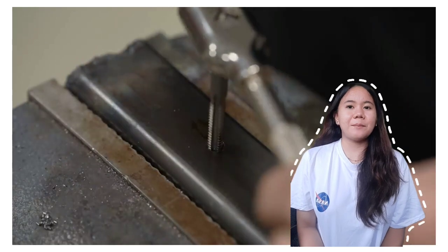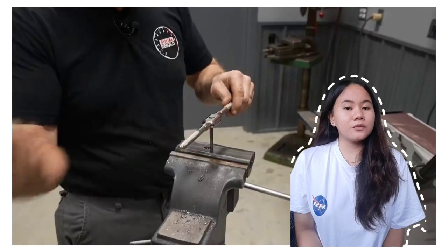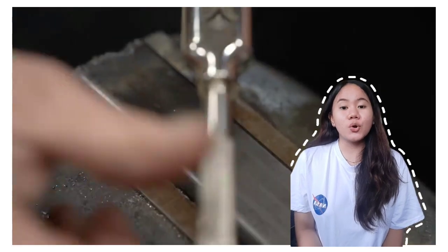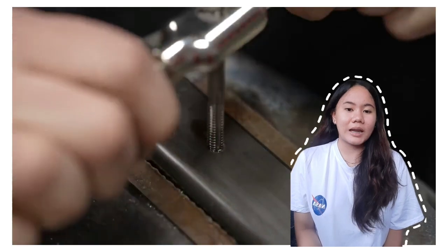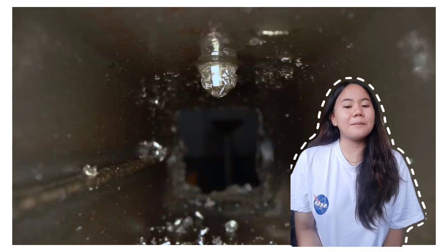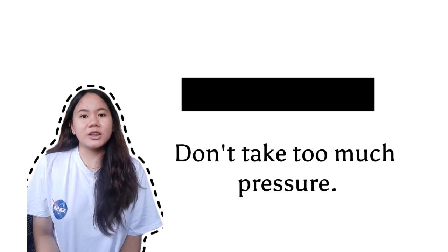After checking at 90 degrees, we can now proceed with the drilling. During tapping, work slowly because the thread tap may be damaged. Apply a little cutting fluid. Then, using the T-handle, push down straight and evenly on the tap. After pushing and turning, you need to pull back to remove excess threads inside and to speed up and deepen the hole. The use of cutting fluid is effective in speeding up the process and preventing the tapping from being too rough. Remember, do not apply too much pressure. Rotate it nicely to avoid breaking the tap.